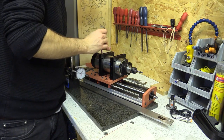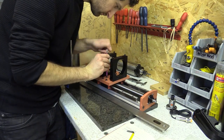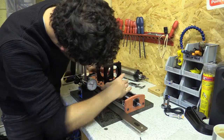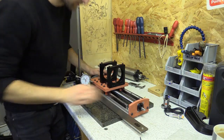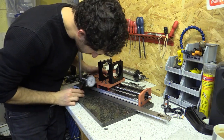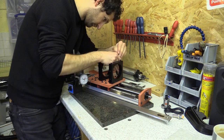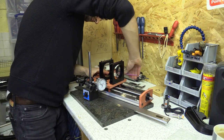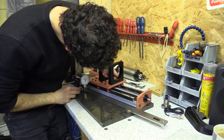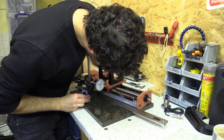Just to make accessing the screws a little easier, I'm going to take off the spindle before loosening all the machine screws holding the spindle plate to the linear rail carriage blocks. I then twist the plate counter-clockwise ever so slightly to compensate before re-tightening. I manage to knock off 0.06mm off the twist, which is barely anything. Maybe I could have got this first time round had I used a dial gauge to begin with, but the method used without it is obviously pretty effective for initial accuracy. It really depends on what tools you have, how much time you can spend, and to what level of accuracy you want to work.